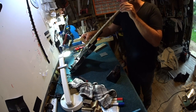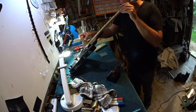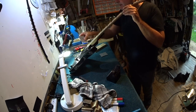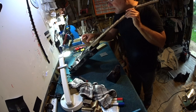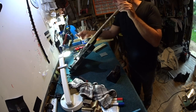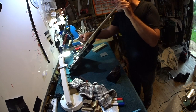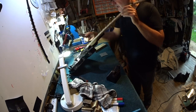There's a gap, and that is telling me that that's flatter than 14. So what have they done this with? No, that's rounder than 16. I don't know what they've actually used. Can't really quite see. That's close to 14, but it's flattened out the ends a bit. So that looks like it's not quite. Do you know what somebody might have done? They might have done a 15 all the way across. That looks close, but again, a tiny few gaps here and there.